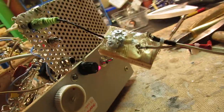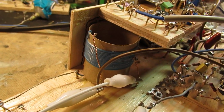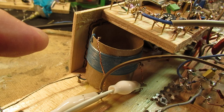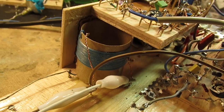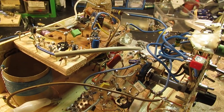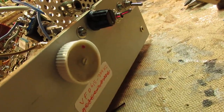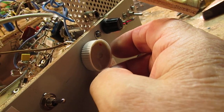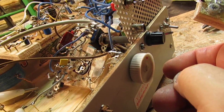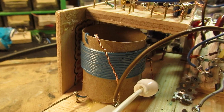And it's a phenomenon that you often see. There is a possibility of a proper reception of one or two radio stations on shortwave, but with this setup, the TRF setup, when the tuning capacitor gets to its highest, not the smallest value, all kinds of radio stations mix together and you will receive them together. And that's what I wanted to show now.